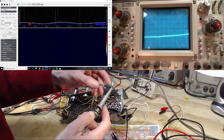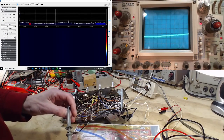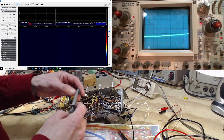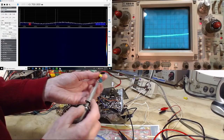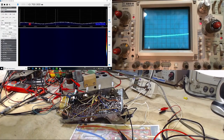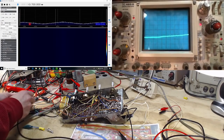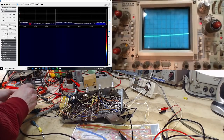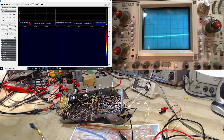Okay. There was a little DC voltage there. 11 volts, that's a little much to stick on the front end of my radio, so I don't want to get rid of this capacitor. But I will try it with a different lead. I can't believe this wouldn't work, which is why I keep trying it every time. Kind of sends back the message, maybe it's not working. So we'll just try a straightforward test lead here.